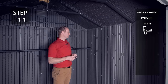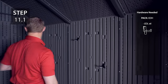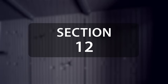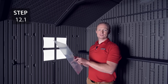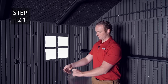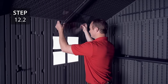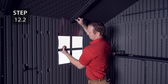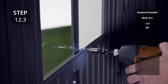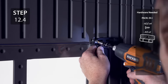Place the wall hooks in the cutouts throughout the shed. Peel the film off the front and back of the window. Place the window in the window frame making sure the tab is at the top and towards you. Insert the screw in the hole at the bottom of the window. Attach the latches at the top of the window through the divots making sure they can move freely.